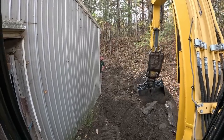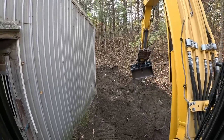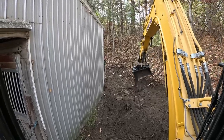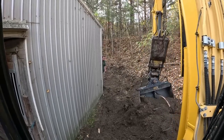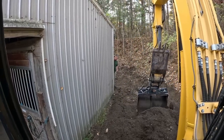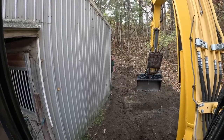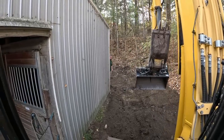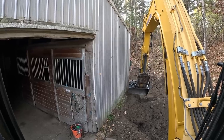We hit a bank of shale. We just opened up the core to act as a natural dry well - that will drain some water in itself. We got the back all established where we want our pipe and our height. We're one foot down from this corner of the building, and then we'll set that pipe at about 14 inches lower than the floor. We'll run it from there and pitch it to the T. We can't see the laser so we need to reset it.